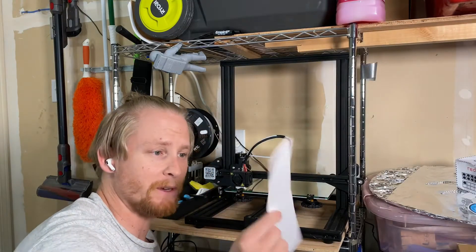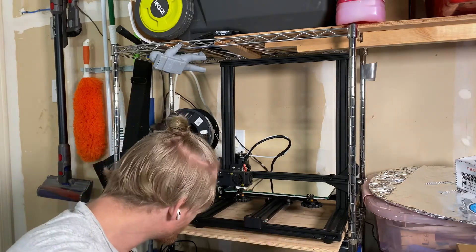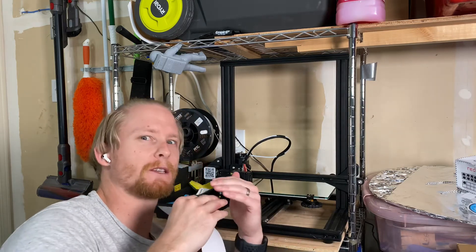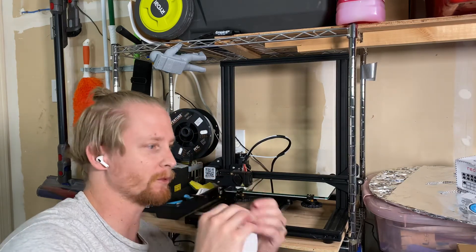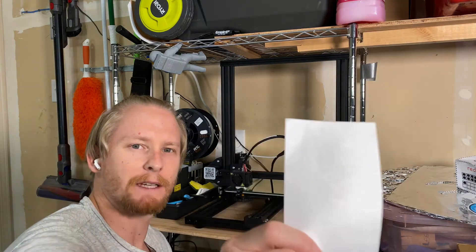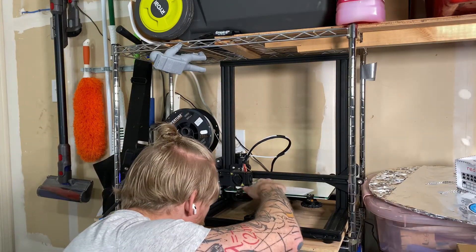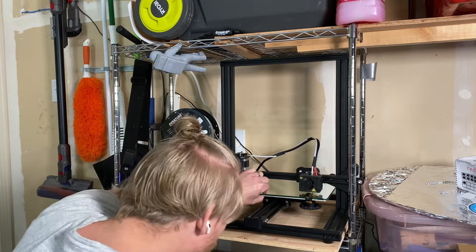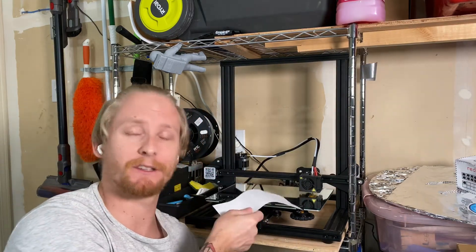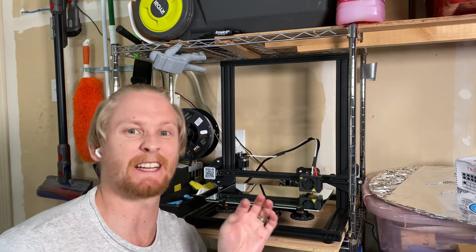I have a piece of paper here that I'm using to test if it's close enough to the print bed. It's gripping and I can't quite slide it back under. I never quite know if it's meant to just be touching or really gripping hard on that paper. It's leaving some scrape marks — so that seems pretty damn close. When doing this, be careful: if you're using the print bed when it's hot, it's hot. This is 80 degrees Celsius and my fingers are getting a bit tender.